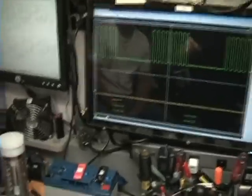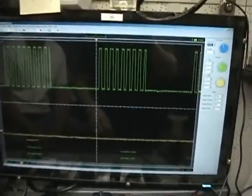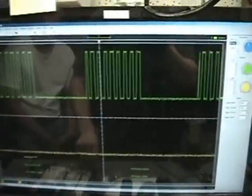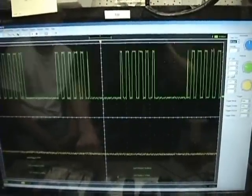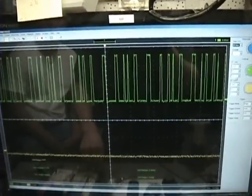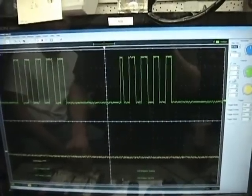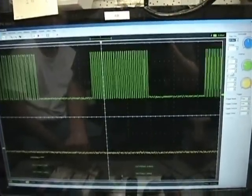Time out — I'm back. I had a few problems, I bumped something, I hate these breadboards. But anyway, here you can see the pulse width and the gating. I can adjust the gating and I can adjust the resonant frequency within the gating by adjusting these two potentiometers.